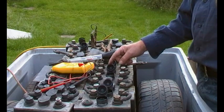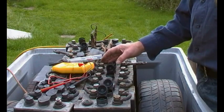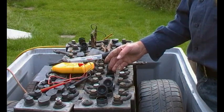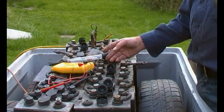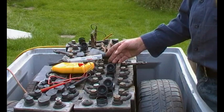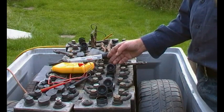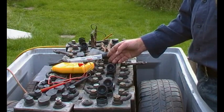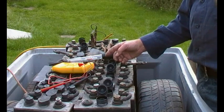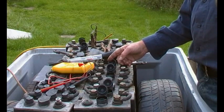So what we're doing here with this pack is boosting all the low cells, then we're going to give it a really long slow charge to bring everything up and even, and then leave it for a couple of days to see if any of the cells have started to self-discharge. You can't rush this — it might take up to a week to get it sorted. But we've got two spare cells in the battery shed being trickle charged, so if we have a problem with one cell we can always swap it out.